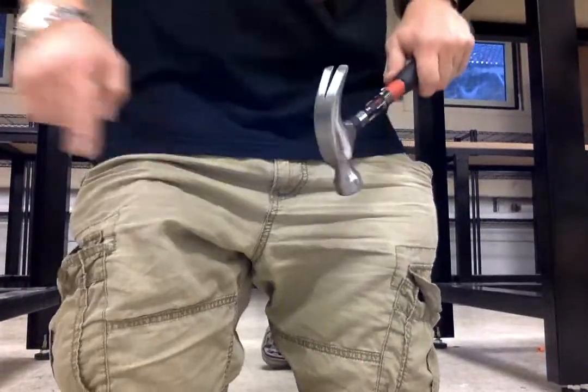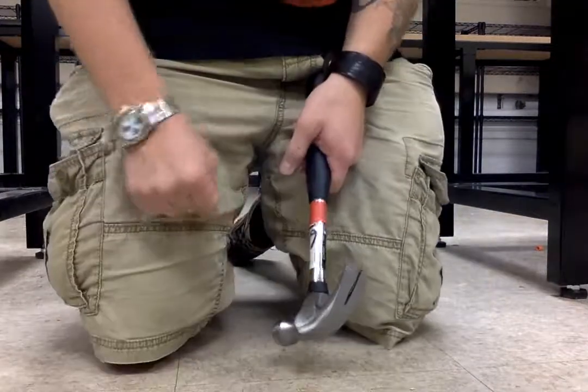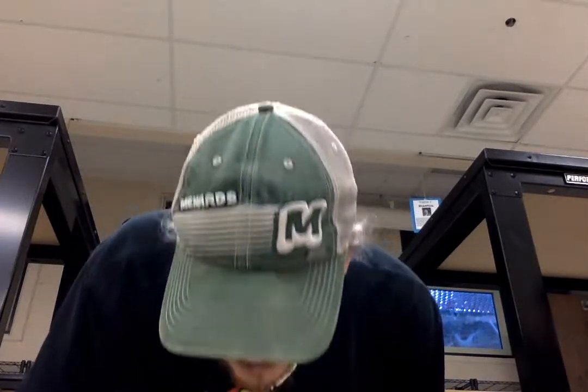Now, if you are hammering on the floor, let me show you how to do it right. To hammer on the floor, we are on the knees. Always be on your knees, hammering on the floor. If you sit back on your knees, don't. Up on the knees. Here's why. When you are hammering, if you are sitting, you will lean over, which means when you hammer, you could take a claw hammer to the face. You do not want that to happen. So when you hammer, you're up high on your knees, and you simply lean over at the waist. Do what you need to do. Again, don't do this, because you're going to get a hammer in the face. That sucks. High up on the knees, bend at your waist, do your hammering.